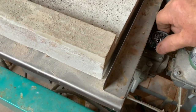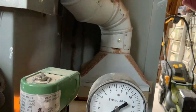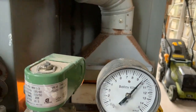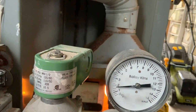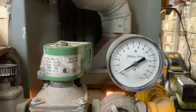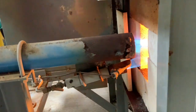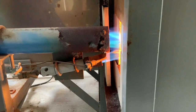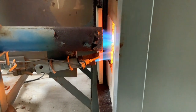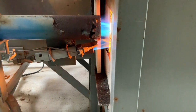I'm going to leave it now for about an hour and a half. It's now 10:10, so it's been going an hour and 10 minutes. The burner is up — you can see it's totally an oxidation-tight flame. Both are still reading zero on gas, so there's barely enough gas getting through but it's enough. The temperature is reading about 700 — 0.7 actually. We've got an oxidation flame reading almost zero, and I'm up to 933 already. It's been running since 7 o'clock this morning — so that's about three hours.